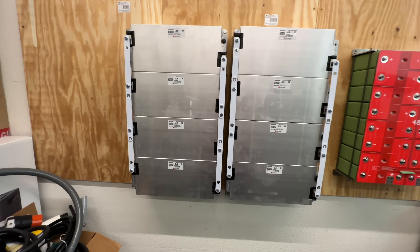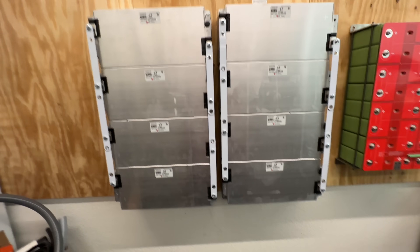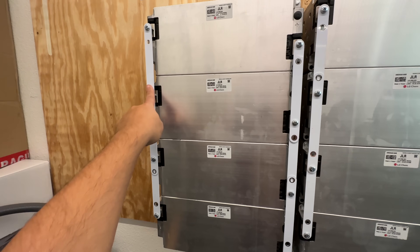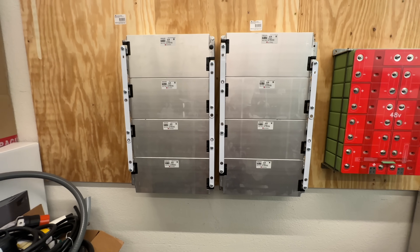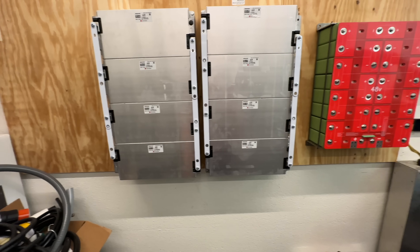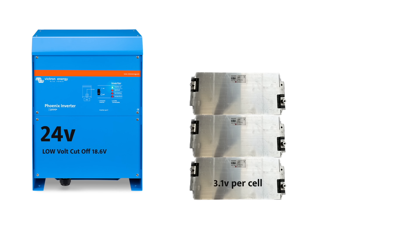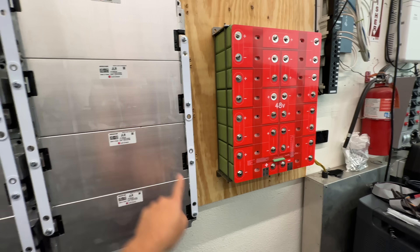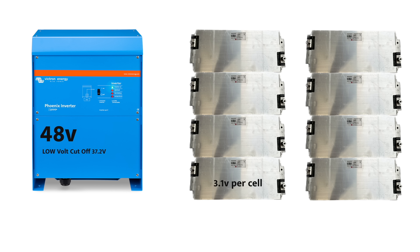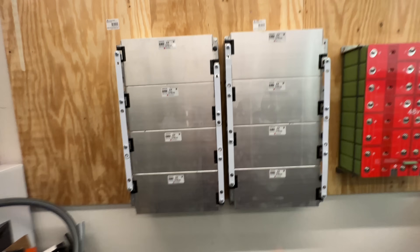These are now all connected in parallel — this is one giant 10 kilowatt-hour 12-volt battery. And then this is another one. If I wanted to run 24 volts, I just connect the negative of one to the positive of the other, giving me a main negative and main positive at 24 volts and 20 kilowatt-hours. For 48 volts you can add two more groups in series, or break them into smaller parallel packs and connect those in series. You can flip them around or run a cable between them — these are like Legos. The bus bars I made allow you to connect a minimum of two modules so you can configure however you want.